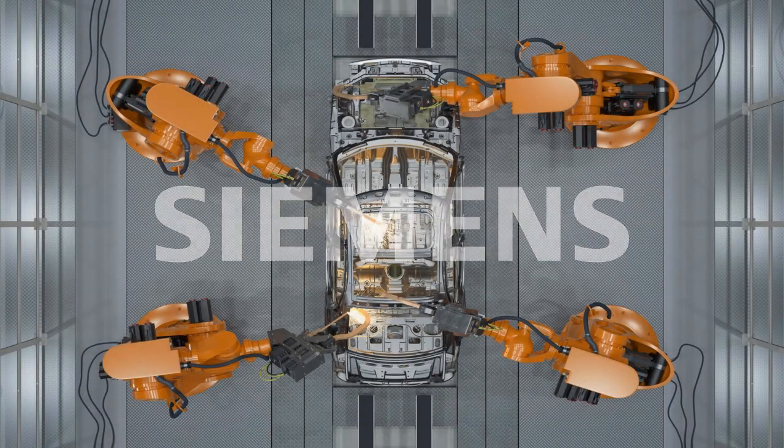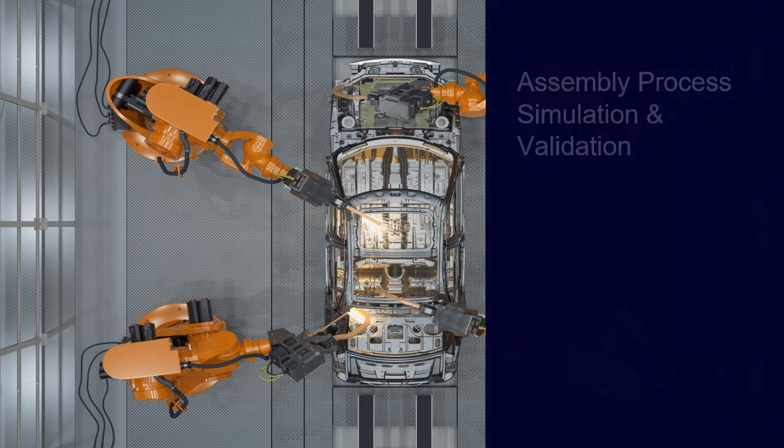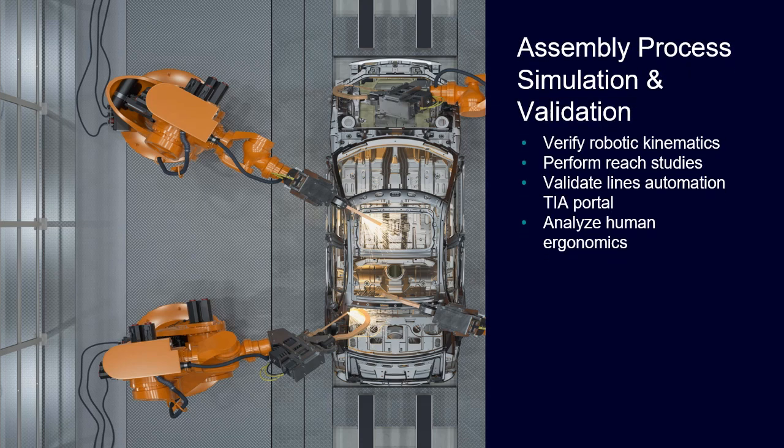Welcome to this video demonstration of assembly process simulation and validation for automotive manufacturing. In this video, I will be validating an existing manufacturing assembly line design to eliminate errors and decrease the physical commissioning time. I will show how to verify robotic kinematics and paths on the line, perform reach studies to determine optimal robot locations, validate the line automation controls with the TIA, Totally Integrated Automation Portal, and analyze human ergonomics to eliminate the risk of injury to line operatives.